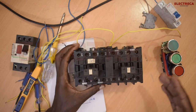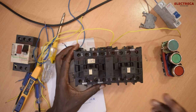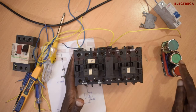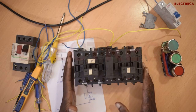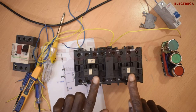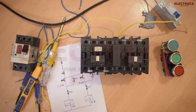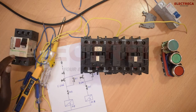Remember, these are two circuits just combined together. But if you press both buttons at once, both circuits can engage — if you press forward it will engage, and reverse also will engage. We don't really need that to happen. So that's why we create electrical interlock, but it is also recommended to double it up with mechanical interlock.